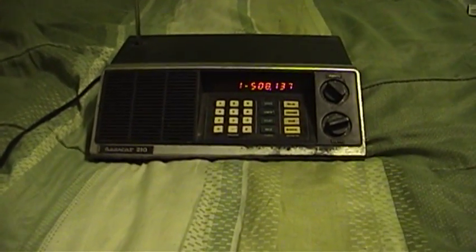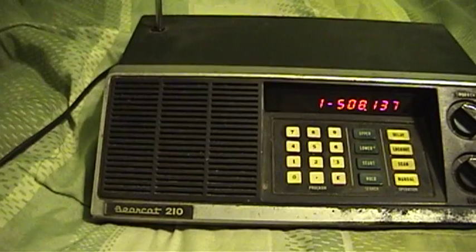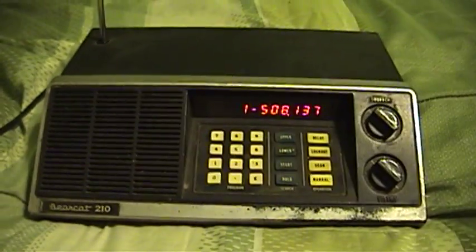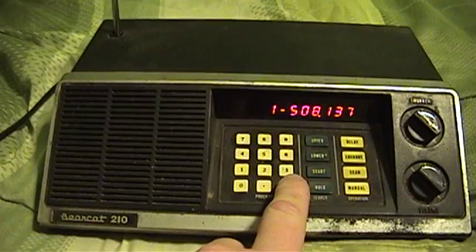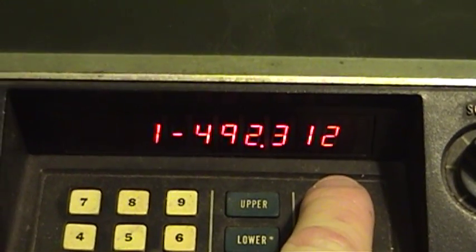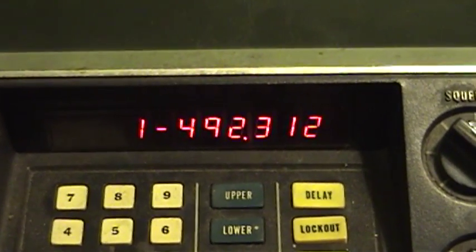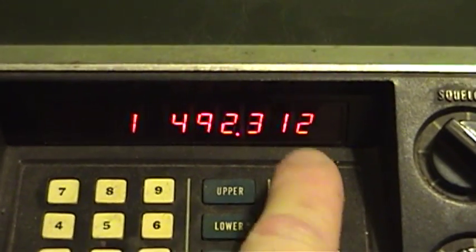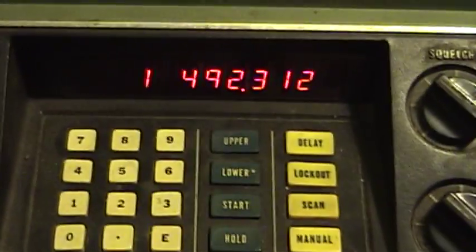Let's have a little demonstration of this one. You can clearly hear the hum from the microcontroller and the faint AC line hum. The hum from the microcontroller actually changes its pitch as you hit buttons — assuming this thing doesn't go completely bonkers. One thing you can definitely see by playing with the buttons is that the microcontroller is very slow, and when its display updating routine is interrupted to handle input from the keypad, its multiplexing and driving of the display goes a little bit erratic while it processes and interprets the key press.